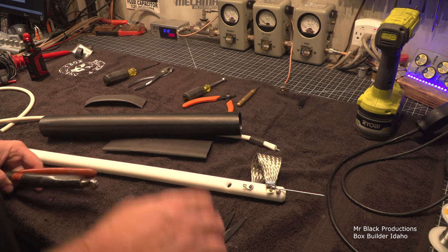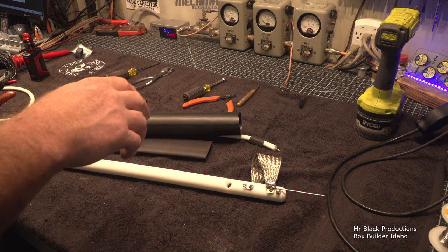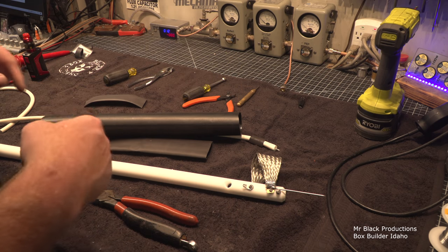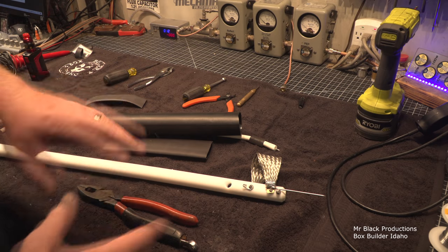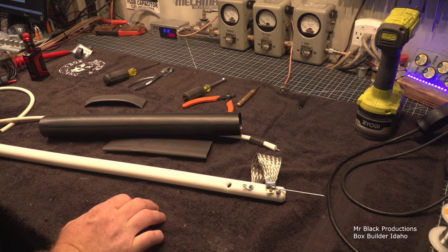It's a clamp that you put on the 5/8 strand. You run the 5/8 strand between the poles, and then you put this clamp on there, and you can tighten down one side of the clamp, and it pinches on the 5/8 line, and then you can attach your lashing wire, which is a form of stainless steel wire that you put inside this machine that spins on the line and holds the cable to the 5/8 wire that goes between the poles.